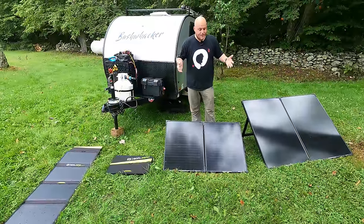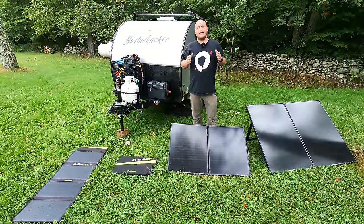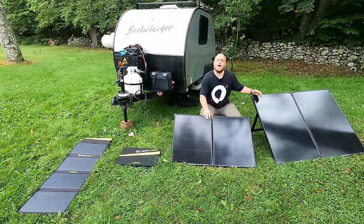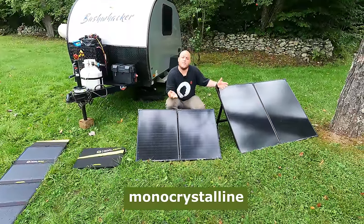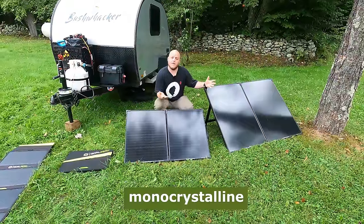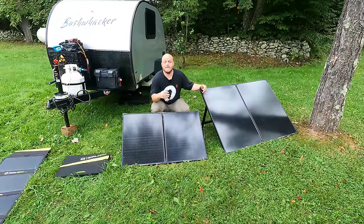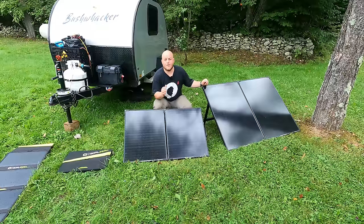Once our battery is sized properly, we can start thinking about solar panels. There are a million and one different types out there, so I'm going to narrow this down and make a couple of recommendations, then break things into categories to compare the pros and cons. For starters, panels can come in monocrystalline or polycrystalline. Monocrystalline gives you more bang for the buck — the panels work better and it's a more advanced technology. My recommendation is to not even consider anything but monocrystalline panels. Most reputable distributors are only selling monocrystalline, but you can still find the less efficient polycrystalline panels on Amazon. They're really not worth your time.